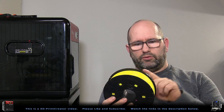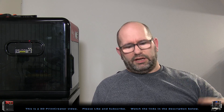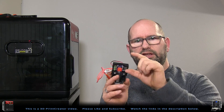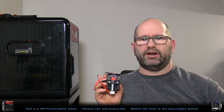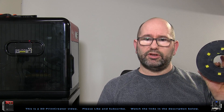Now let's talk about the filament oiler pot system. Filament from the roll goes through the printer — if you have a Bowden setup, it goes through the extruder, then the PTFE tubing, then into the hot end. If you don't have a Bowden setup, the extruder sits right above the hot end and you can forget the PTFE tube. With the oiler box, there is a way longer path the filament travels, and also way more oil is used because of the sponge and oil inside that small box.